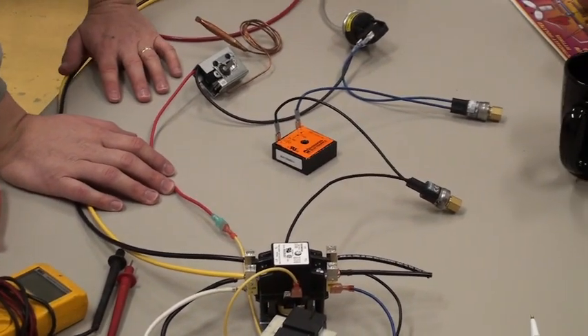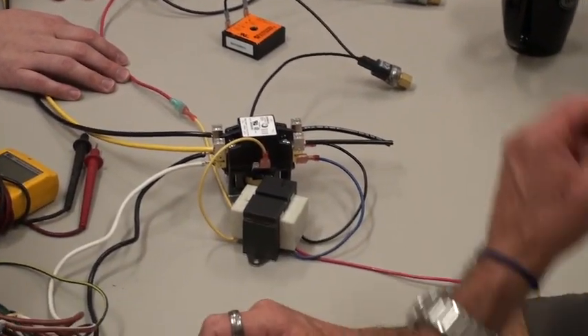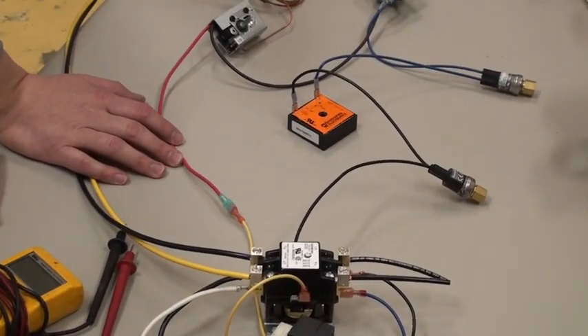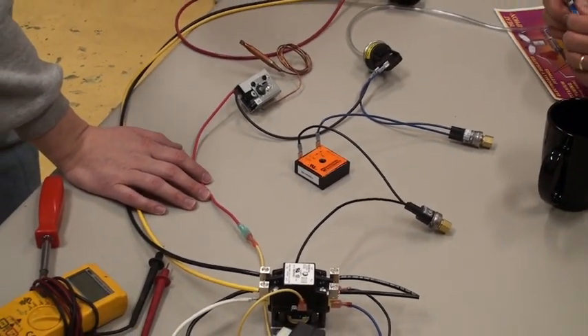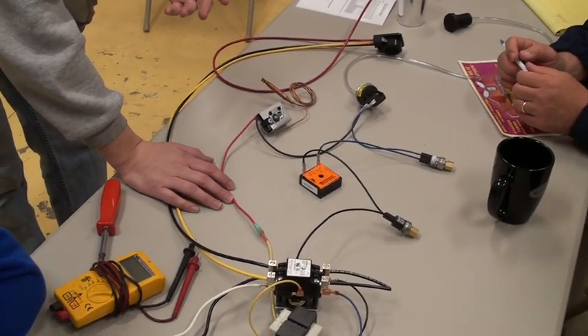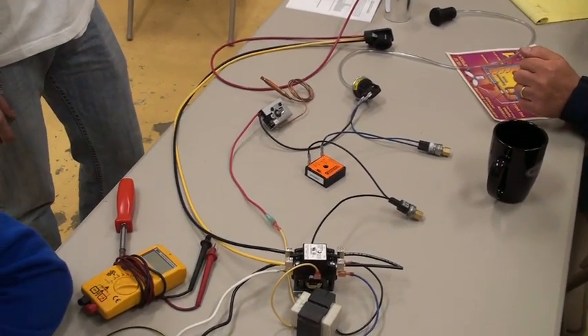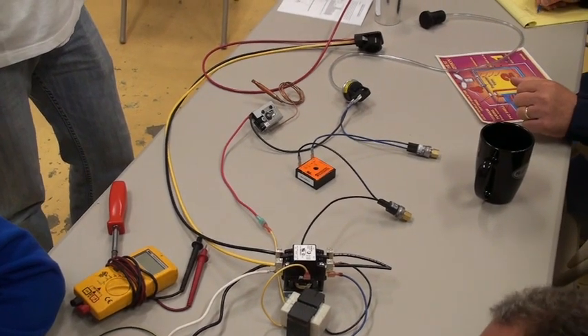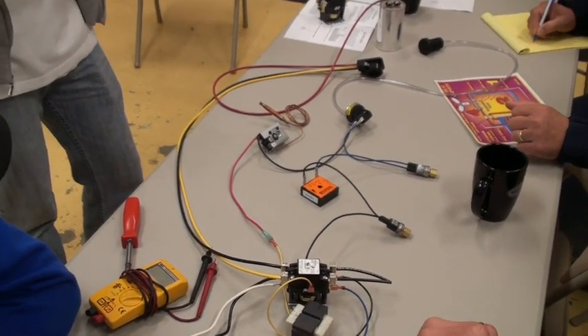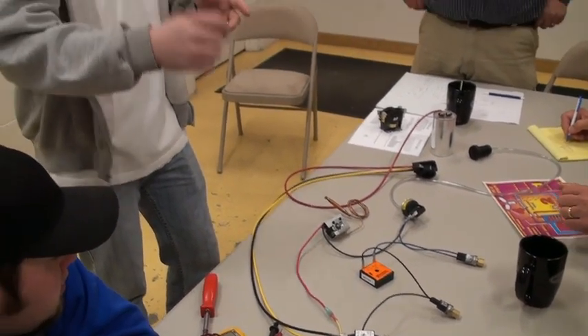That's for if it was a 208-volt, for our 50-hertz units — I think we used the red. You'll see that taped off usually in the other units. We leave it there in case someone bought the wrong unit, like one recently in the Canary Islands that used 50 hertz. So if they ordered the wrong unit, they can still use that tap.